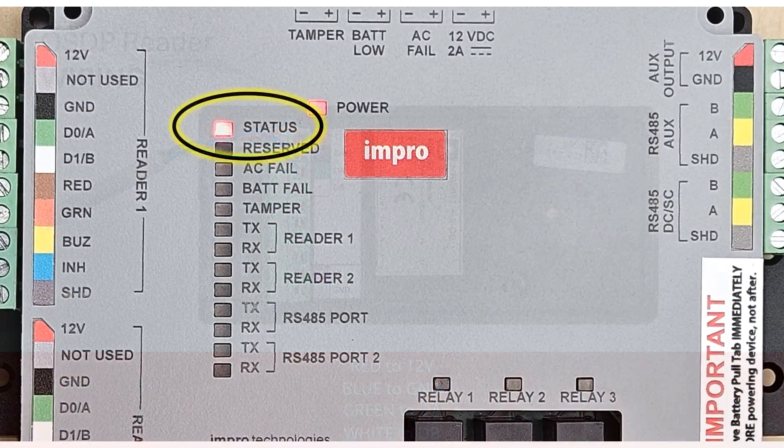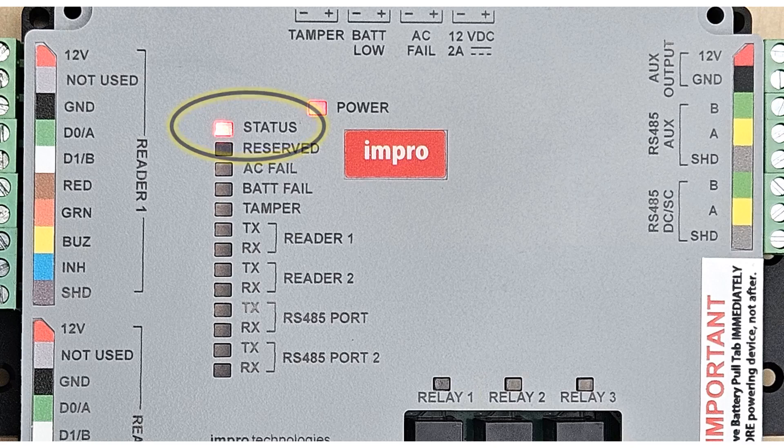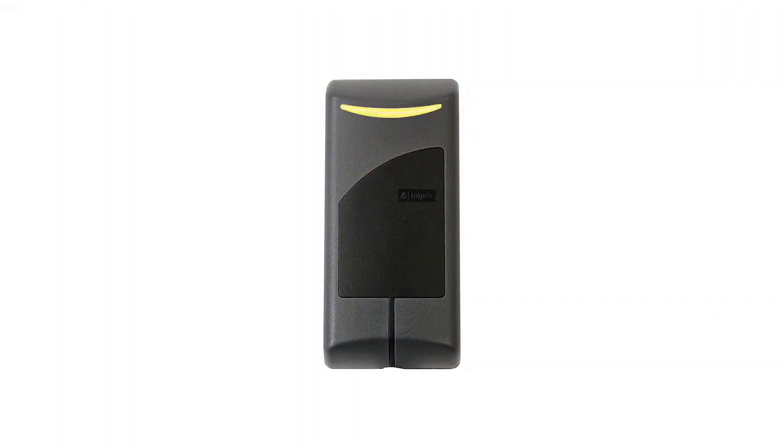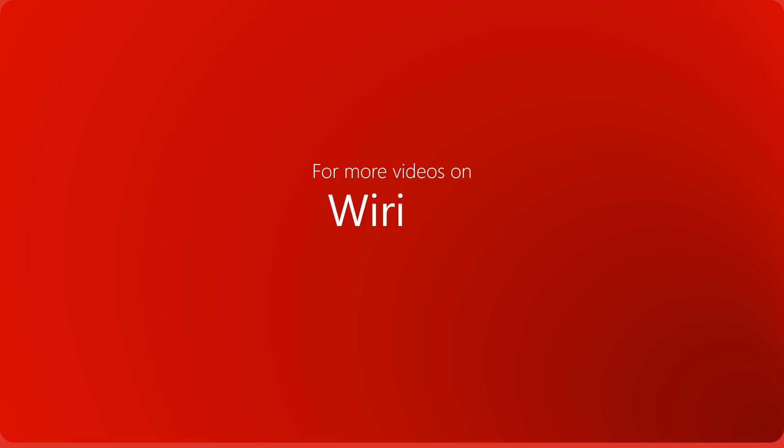Return to the slave ITRT2 and power it up, allowing 30 seconds for it to boot. The STAT LED should eventually glow continuously, indicating you have communication via the RS485 cable. The OSDP reader should now be powered up and flashing yellow. This installation is now ready for setting up using AP Lite, Access Portal, or Primo software — that will be the subject of other videos.